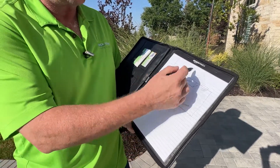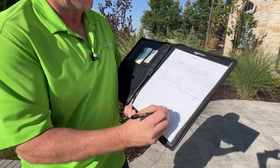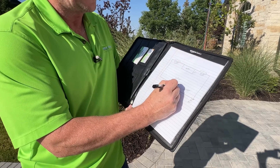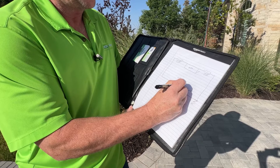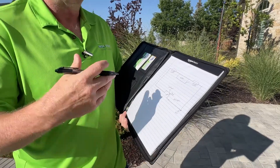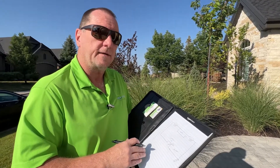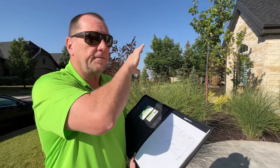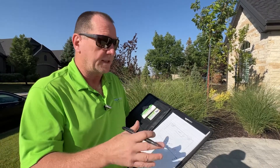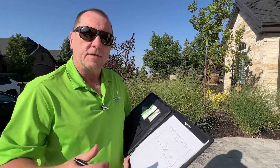There's the front door, here's the garage and the rest of the house. As I walk through and select camera areas, I do two things: I mark a location where the camera is, the area it's going to cover, and the maximum distance it needs to see. Same thing with the porch — I put a camera right there with the coverage area and distance noted. This helps when I go back to the office to do the design. You can also just take pictures of the areas with your phone as you go around the house — it reminds you of the locations and distances.